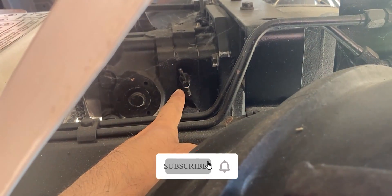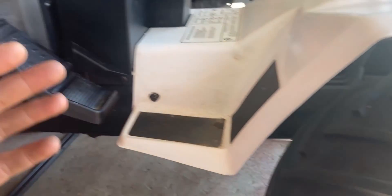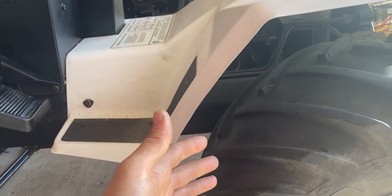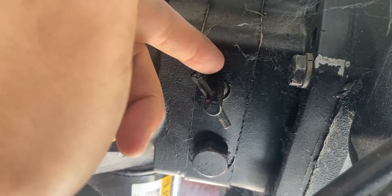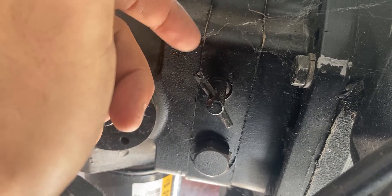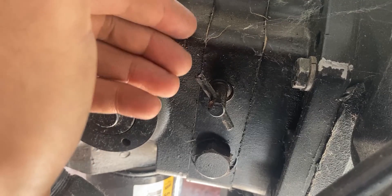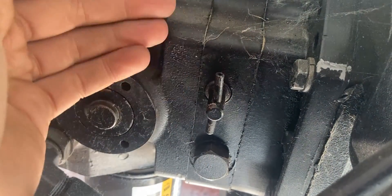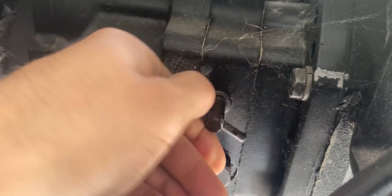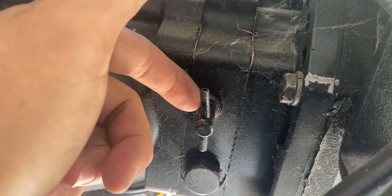There is a T-handle on this side of the inline pump. If you want to move the tractor forward or backward without turning it on — in case you want to pull it somewhere or it needs to be towed — you want to open this freewheel valve. This is closed right now, so righty-tighty, lefty-loosey — you want to loosen this off. If it does not open it might be seized on the thread, or possibly the O-rings are bad inside, so you really want to make sure this works and that it is closed when you're running the tractor. If not, this could also cause an issue where your tractor is somewhat jumpy. You want to open it at least one turn — that will give it enough room to push the fluids while you push the tractor around, but I'd open it two turns. That's what you want to do if you want to freewheel this tractor.